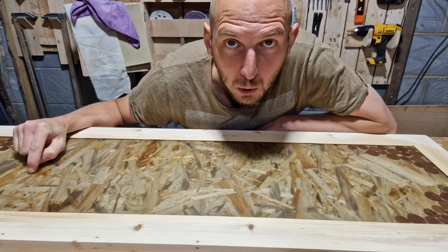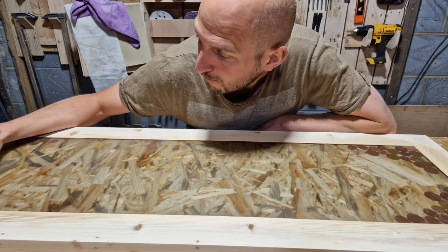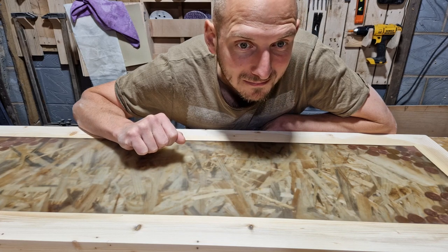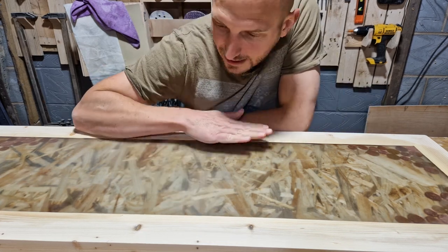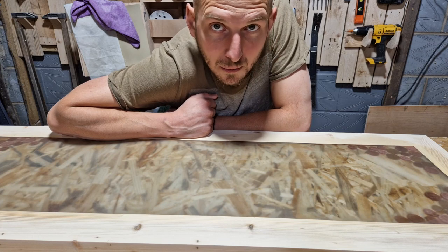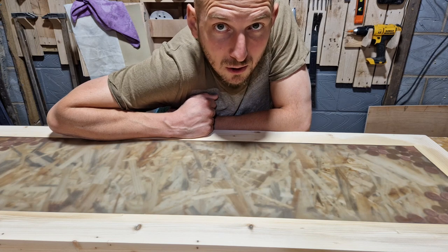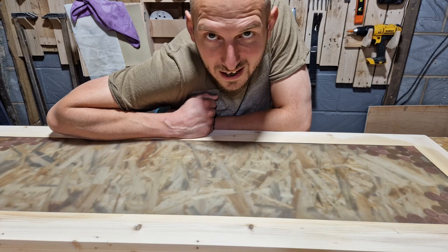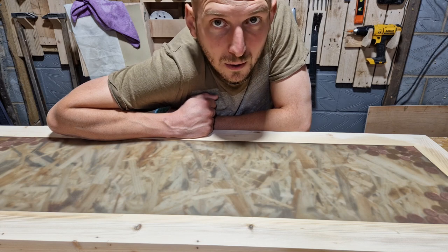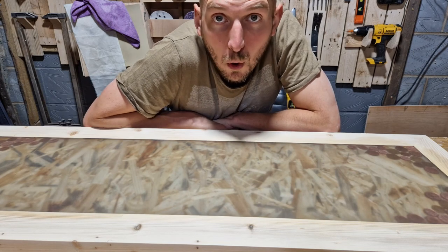It's clear, and there are no swirl marks. Now I have got a little air bubble that's appeared here - trouble is it's full of dust and I don't know how to get the dust out. I've spotted it too late to actually fill it with super glue. As you can see, as the water dries it kind of hazes over again, but that's because it's not been polished. This has left me with a bit of a predicament - I've put all these hours into sanding it and now I feel I've got to see the project through. But to really finish it, it's got to be polished and buffed. I didn't want to spend another 50 quid on a polishing machine, pads, and polishes. So I'm going to call this part one of the video.